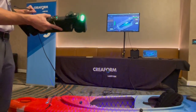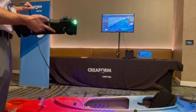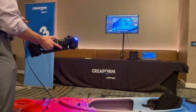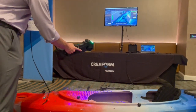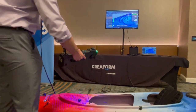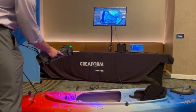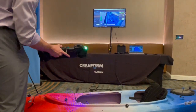If you look on the screen in the background you can see these bounding box planes. This is a really cool feature — we now have automatic bounding box planes that we can place around objects while scanning, and it knows not to collect any extra data or overspray from the scanner. So now we get a really clean data set that we don't have to chop up or delete facets from.